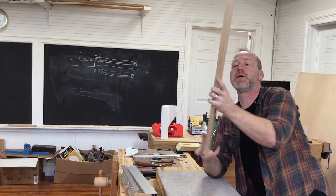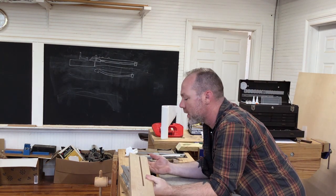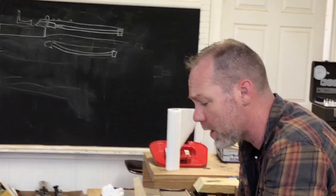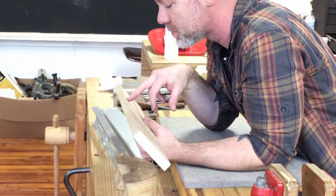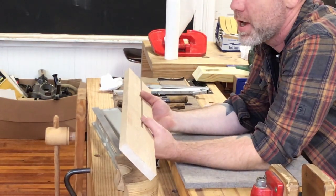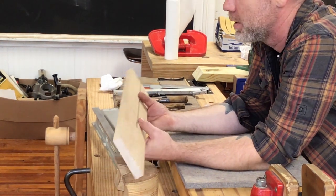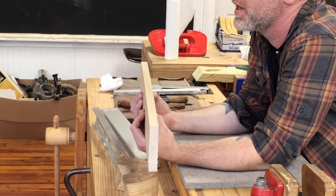I did an experiment. This is great. I bought these maple blanks. They were this one, that one, and the other one that you're holding. They're all the same dimensions. And I weighed them. This was 2.1 pounds. And then I took them home and I put them in my oven for 5 hours at 335 degrees. And I just cooked them. Wow, just like torrefaction. Yeah, it's kind of like torrefaction.